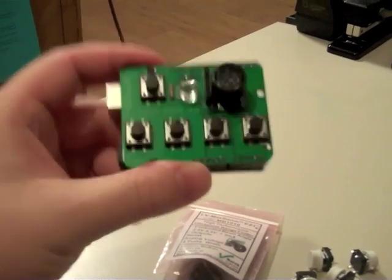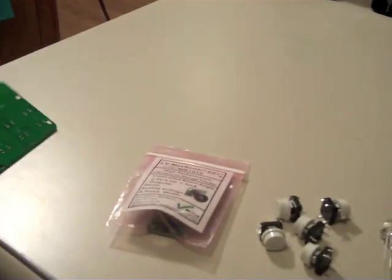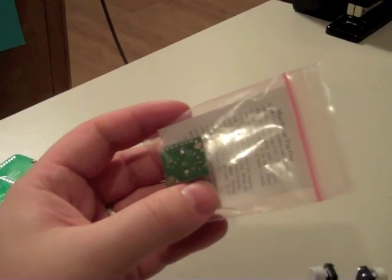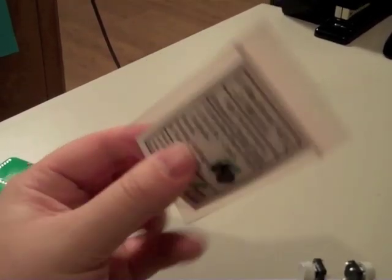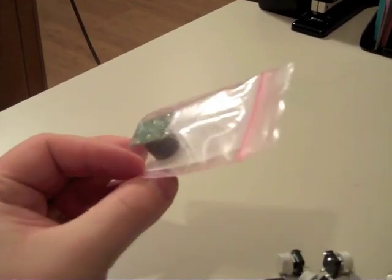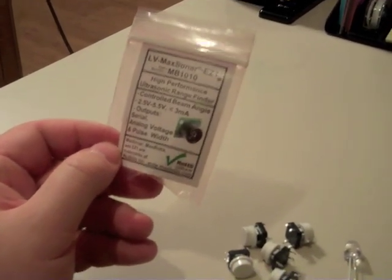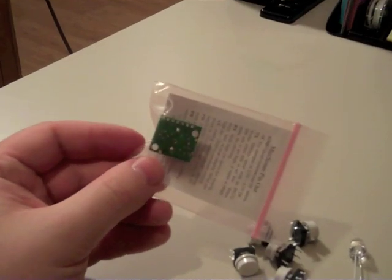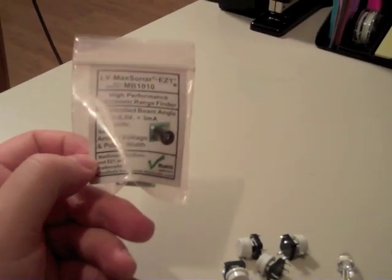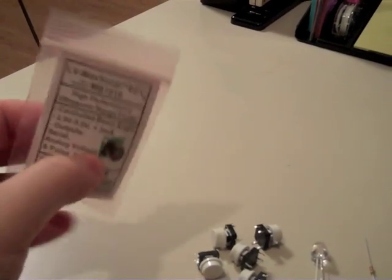Okay, first of all, to build one of these, you will need an AirHarp Shield circuit board from lyratron. You will also need a Maxbotix LV-EZ1 ultrasonic rangefinder module. You could also use any of the other LV-EZ series rangefinders. We originally built the AirHarp with an LV-EZ4, which is just a narrower beam. It doesn't really matter. I believe their other rangefinders from Maxbotix also are pinout compatible with the LV-EZ series. So pretty much any rangefinder that's compatible with the pinout of this should be fine.